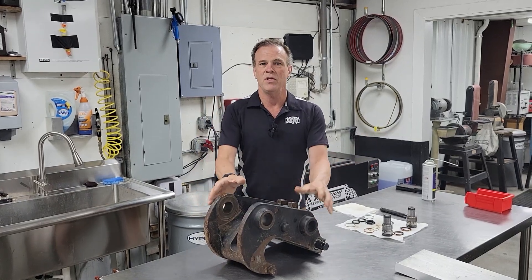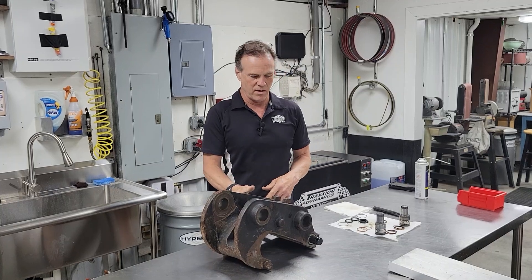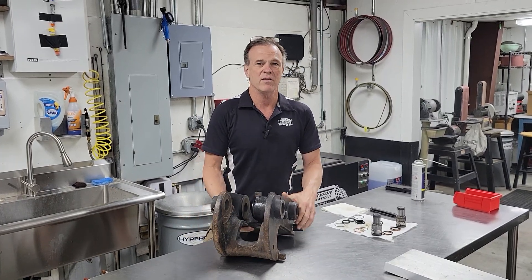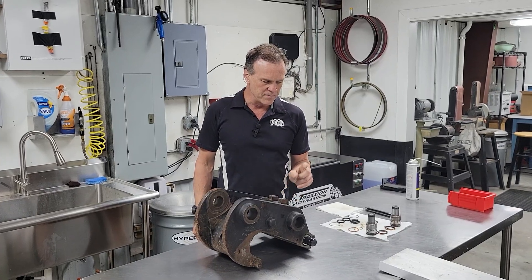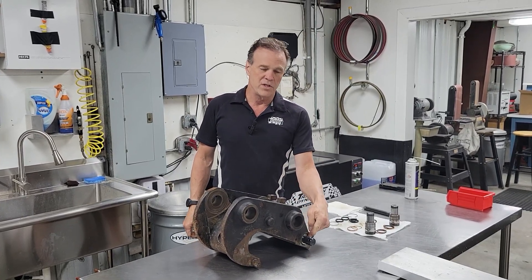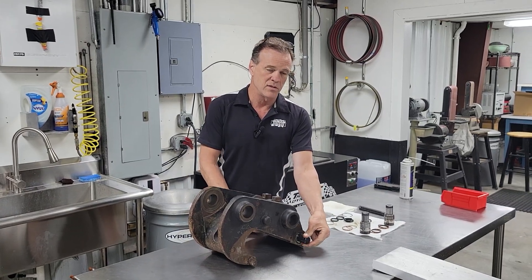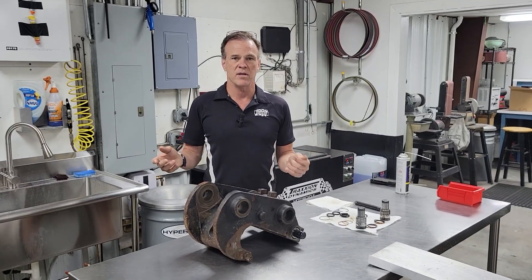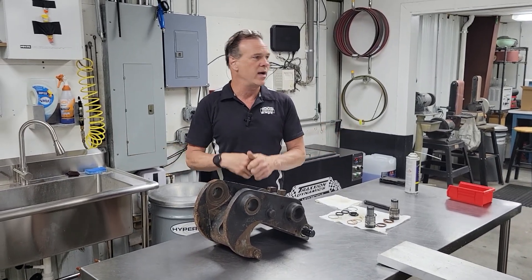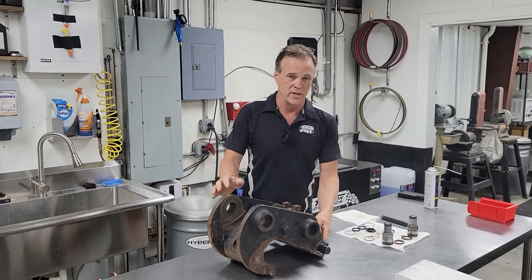First thing: removing the piece. If you need help just getting this thing off, you're already in big trouble — don't do it, just give up. Hopefully you can get this chunk off and get it on your workbench. What you're really going to be having trouble with most of the time are these two pistons that actually hold your bucket on. They retract. Once they're messed up and damaged, the seals leak and you retract them and oil starts shooting out the side. You're probably already to that stage and that's why you're here.